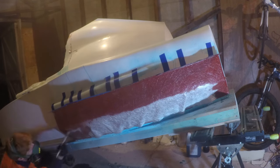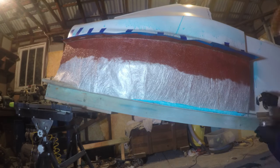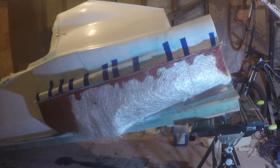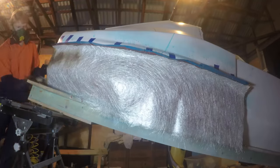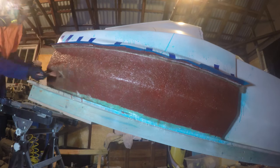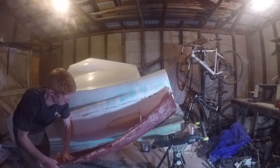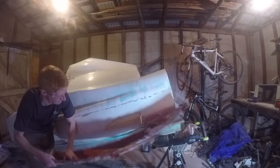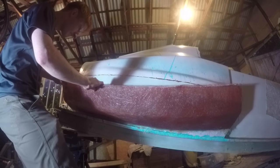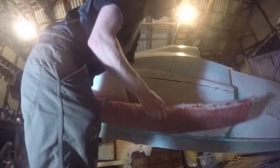I was not too bad with safety on this project overall, but I had one incident while making these moulds — I managed to pour some resin onto my leg. I dropped everything and got my clothing off but it had soaked through, giving me quite a nasty chemical burn. The resin was incredibly unpleasant to work with. I used an epoxy system for the bodywork instead, and in future I'd wholeheartedly recommend going that way even with the added cost — it was just so much safer to work with.